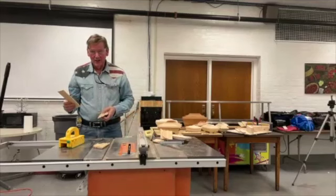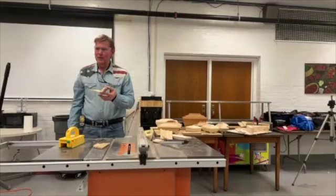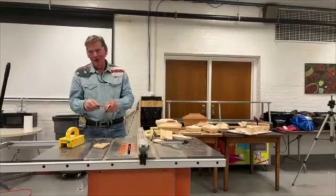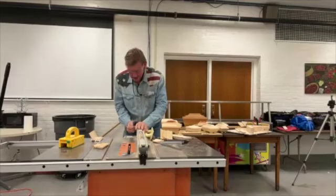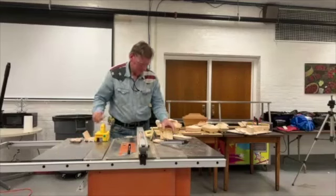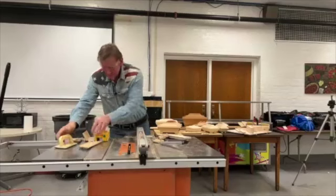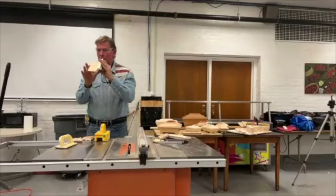Now, I'll give you a hint that's going to make your life a lot easier. The 1/8 inch fits in these. It fits in there snugly right now. This is going to bite you in the butt when you go to glue this together. Move your fence over 1/32 of an inch. You want a slightly sloppy fit here because God forbid you didn't get the angles just right somewhere. If you're locked in here, there's no free play. So I would just take the fence and give it a slight tap. At least that much we're going to use.